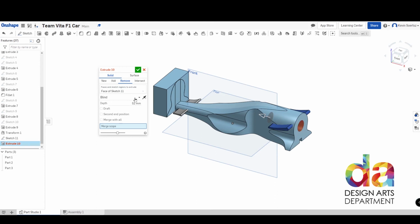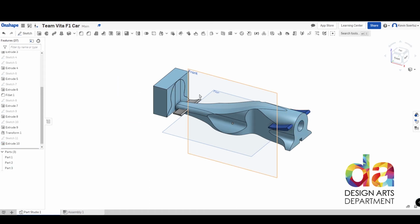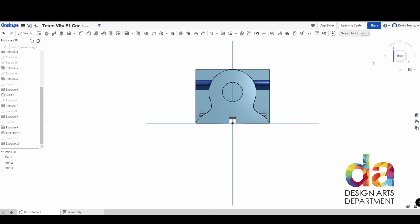And we need to make sure that it's cutting through our part as well. So right now it's doing the same operation of cutting through our F1 block, but it doesn't really register this fin in the way. So we need to choose that part. So I'm going to click here in our left menu, part 3. And that has also included part 3 down here in the extrude box. So let's click the check mark. Go to right view. And as you can see, we've cut through the fin. And now our channel is completely clear for the CO2 canister.